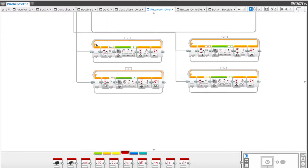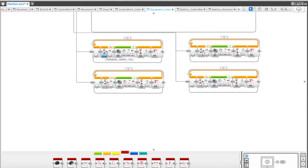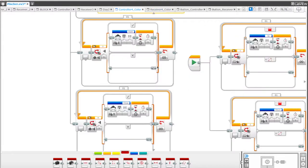Down here these are just the signals — open, close, up, and down. I use simple commands. If touch sensor on port four is pressed it sends out 'close'; if number three is pressed it's 'open'. Then there are the color sensors waiting to see red, and if those are true it sends out those signals. On the receiver side when it receives that, it turns the motor on at 30 power for 100 degrees, and the same thing going the opposite direction — a negative power — to lower the claw. So it's really pretty simple on the back end, and this is where you can manipulate your code to have your robot move accordingly. You can adjust these numbers to calibrate to your liking.